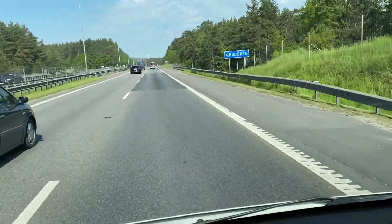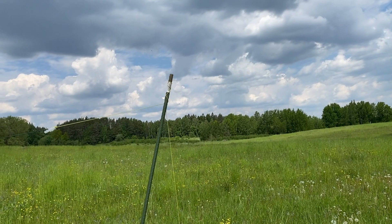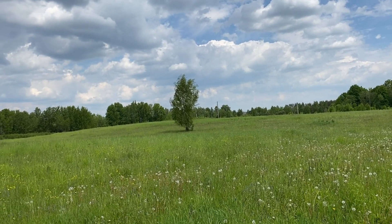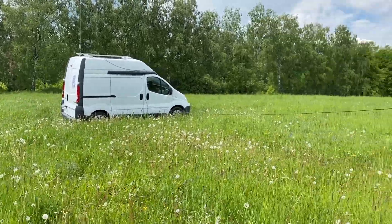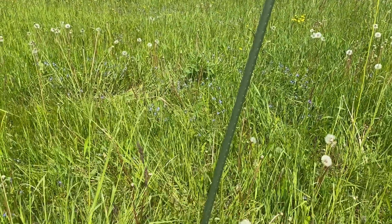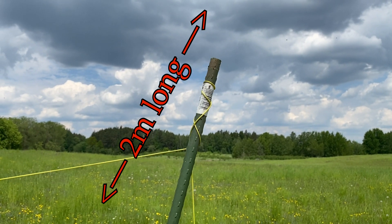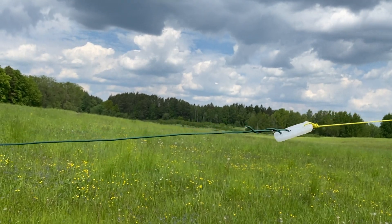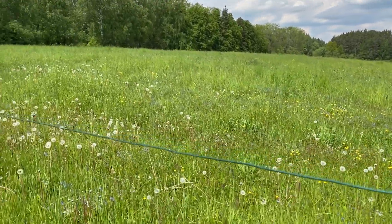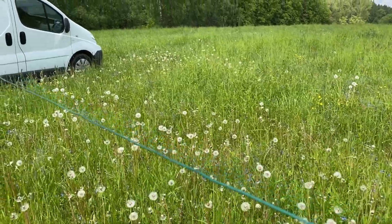That's fun! I'm in a fantastic field now, but there are no trees to put up the antenna. I do have the gardener's pole with me at all times — a very useful device for supporting the rope or counterpoise. My counterpoise is just my 13-meter wire, which I otherwise use as a random wire antenna with an antenna tuner, but today I'm using it as a counterpoise.